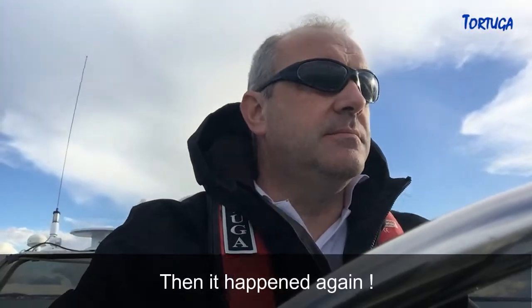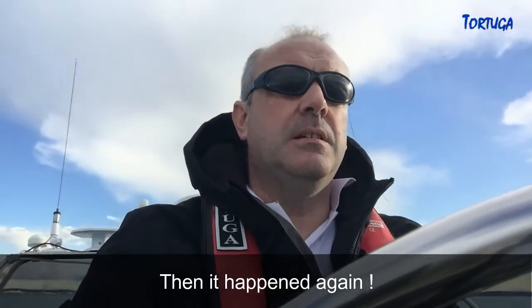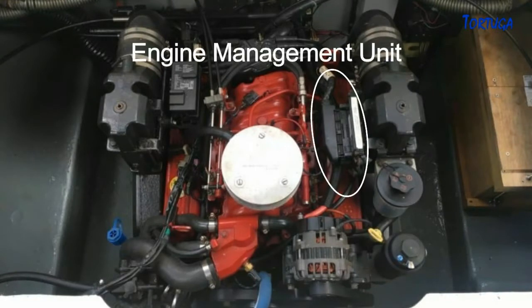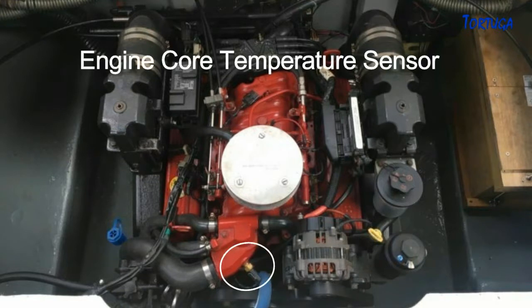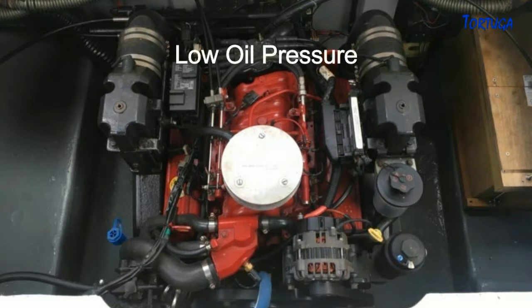The engine's sitting comfortably. The engine management unit mounted on top of the engine had activated the engine safe mode and reduced the power. Engine safe mode is commonly activated when the computer senses a high temperature reading in either the engine core or a low oil pressure. However, according to the instrumentation, these readings were normal.